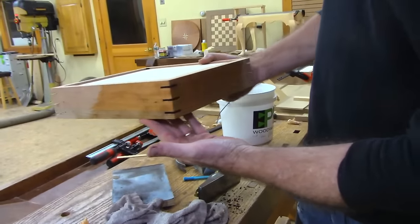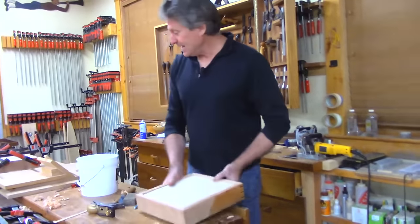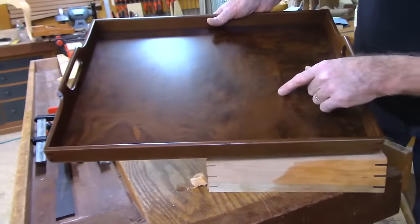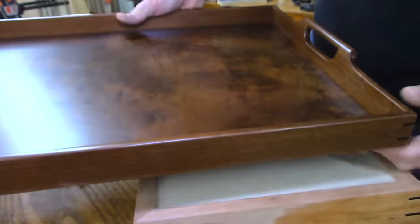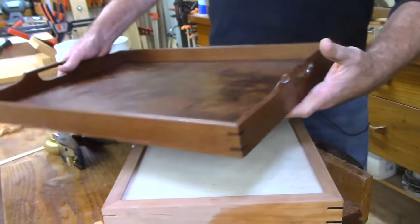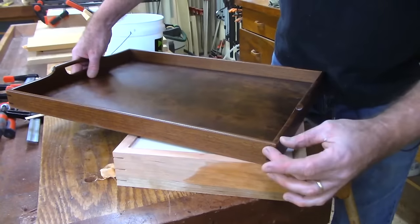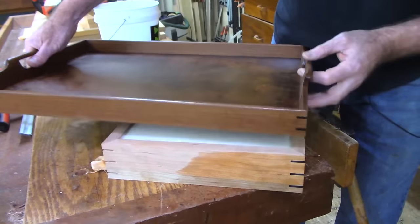Throw in those ebony splines and someone sees that thing — 'oh yes, those are ebony.' Let's get our tray back over. You can see these are a little more discreet on the tray, but you come in and you see those dark black spots and circles on the burl, and how that relates nicely to the ebony splines on the edge. This composition utilized the exact same technique I just showed you — an internal spline that aided the glue-up and strengthened the corner, and then the decorative and functional external splines put in after the fact.